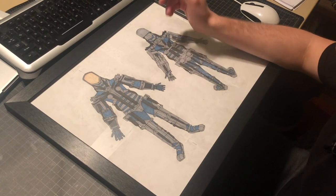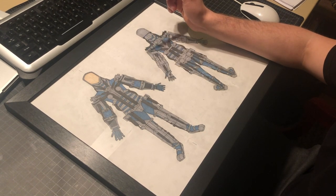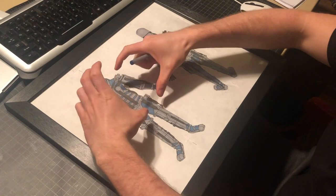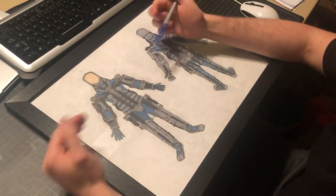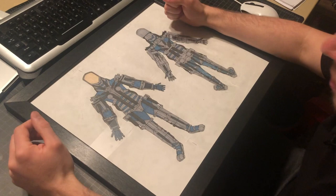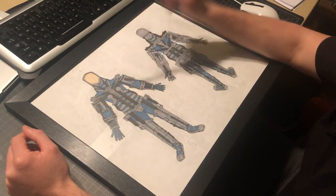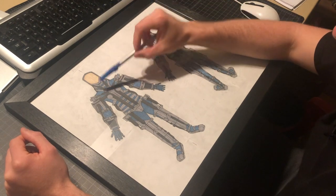The main reason for the ball-and-socket joint design here is that it allows for a really high amount of downward force. I calculated four muscles at 30,000 pounds each — that's 120,000 pounds — plus two at 10,000, totaling about 150,000 pounds of force pulling down on this part. These parts have to be really strong in a load-bearing direction. Tensile strength — being pulled apart — doesn't have to be as strong; there'll be Kevlar reinforcement for that.